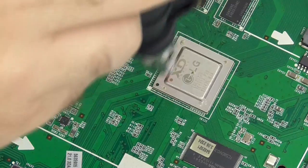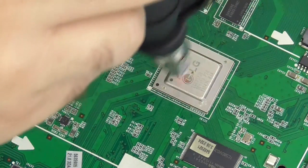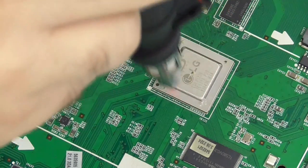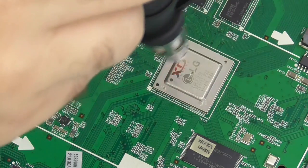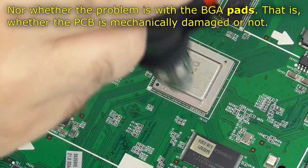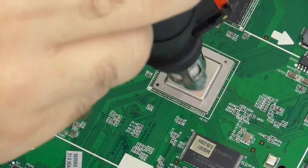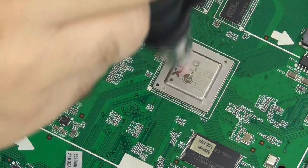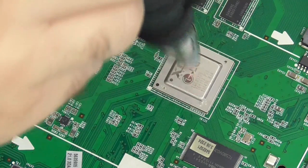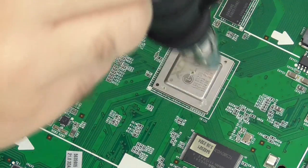Normally I would work off the flux, and this solder paste was something I thought would be interesting to try. It could be something to do with the fact that the solder paste is off and it's not properly melting - at least it doesn't appear to be. I'm not going to move the chip to find out whether it's actually melting the balls, because I don't know what the density on that BGA is. I think I'm going to say that the solder paste experiment didn't work. I don't want to touch the chip with my thermal probe because it will probably move it if it is molten, and if it moves I don't need to measure the temperature.